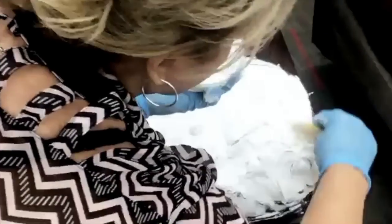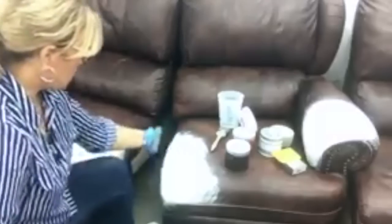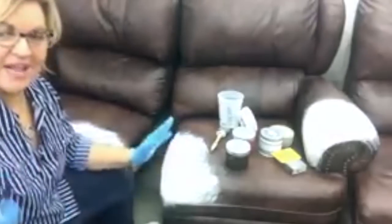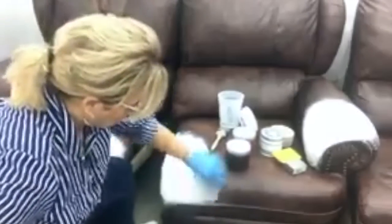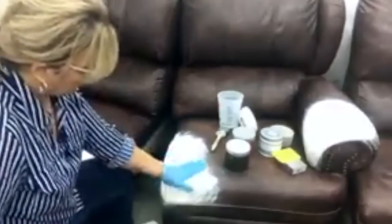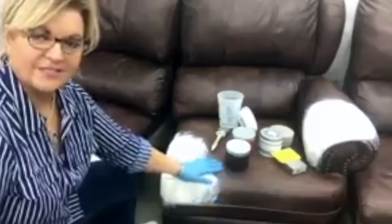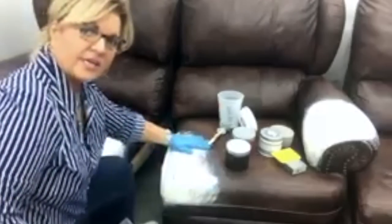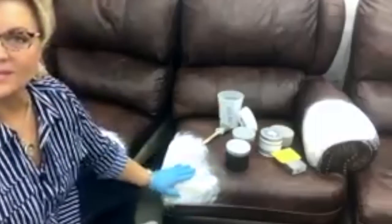So this will be a couple-day process for us to get this thing back in order. Once we get it all on here, we're going to sand it smooth — sand it, build it up, sand it until we get it. We've gone in, filled it up, got everything tucked back in. It's still a little pliable and soft, so it will sand very easily even after it has cured out. This is going to take several days to cure — it's really too early to paint it, but I'm painting it anyway to show you, and it will still continue to harden and cure. After I put on the Bond & Flex I used my glove and smoothed it, dampening my glove by just dipping it in a little water. I put the Bond & Flex on, let it set up for about 10 minutes, then smoothed and finessed it, feathering it into the other areas so that layer is very thin and hopefully less noticeable when we paint.